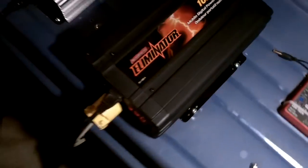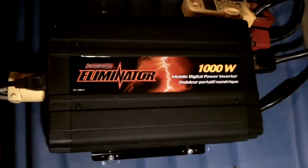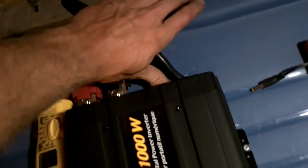And that's it right here. Let's get more lighting going. I'll also plug this light into the inverter as well — one more thing off the battery. Alright, so it's a thousand watt pure sine wave inverter. I've been running it for a while, slightly warm to the touch. The fans just kicked in from thermal — they do not kick in from load, it's thermal only, at least from what I've found. The load is saying 390 on here, but on here it's 400 — it's pretty accurate.